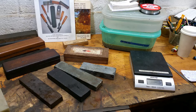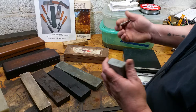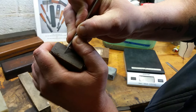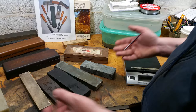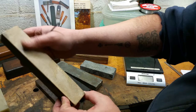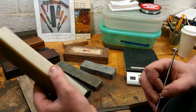The scratch test will not indicate whether the stone is coarse, fine, or medium — it's just a scratch test — but it will help you hone in on what you're working with. For example, this known stone should scratch almost like a fine powder but it's hard. Compared to this washita, which is novaculite, it skips over the edge more. The scratch test won't tell you the quality of the stone but it will point you in the direction of what the stone geologically or synthetically is. A translucent Arkansas stone is almost always unmistakable — they catch light, and listen to the sound.